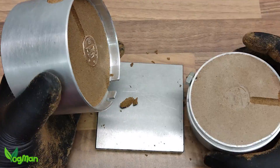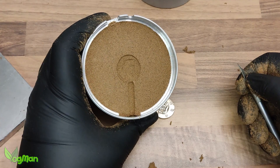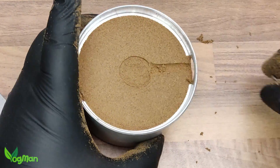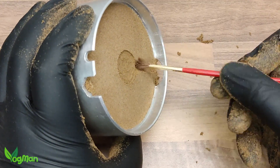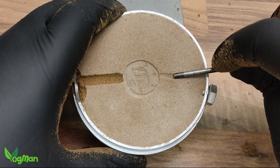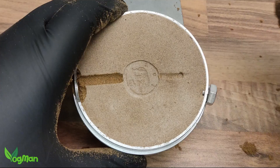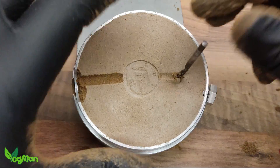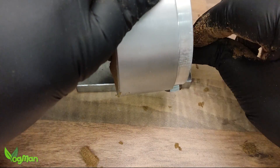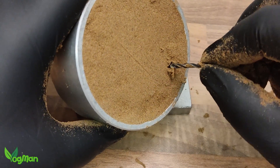The flask is gently pulled apart. Very carefully the pattern is prized free. I'm very gently pushing at the sand to widen the contact point between where the metal will enter the void. When the metal is poured, air will be trapped within the sand, so directly opposite the feed point I'll scrape out a small vent. I'm using a 2mm drill bit, but a cocktail stick would work fine. Don't go too deeply as we don't want our vents to be too big. The advantage of the drill bit is that it can be twisted to help it pass through the sand, and is then pulled free on the other side.